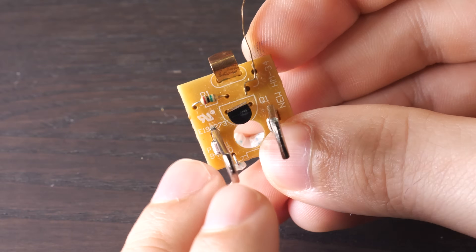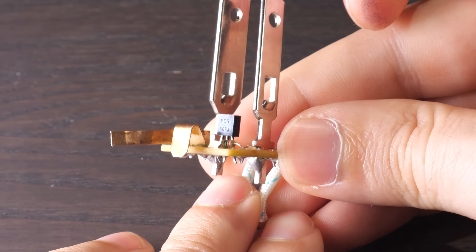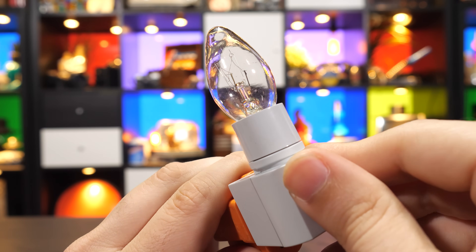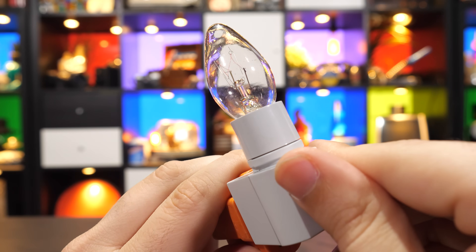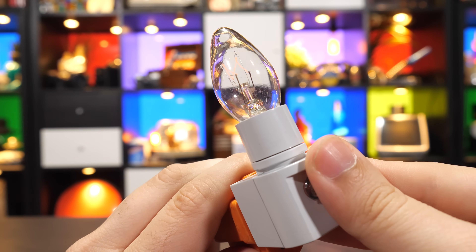Because of the way this circuit works, some current is always flowing, but it's hardly any at all. That 2 megaohm resistor at 120 volts dissipates a whole 0.0072 watts — and that's assuming it's wired directly to neutral, which it isn't. It's in series with the lamp filament, which adds another 400 ohms or so. The thyristor needs absolutely minuscule amounts of current to become activated, so while this circuit is technically drawing a little power during the day, it's practically zero. Also noteworthy: thyristors exhibit a sort of latching behavior, and once activated with sufficient current flowing through the gate, stay activated until the zero crossing of the AC power cycle. This is why the lamp will fade to life as it gets dark rather than just snap to full brightness — when most but not all of the activation current bypasses through the photoresistor, the thyristor will periodically kick the lamp to life at the tail end of each power cycle, behaving much like a dimmer switch.